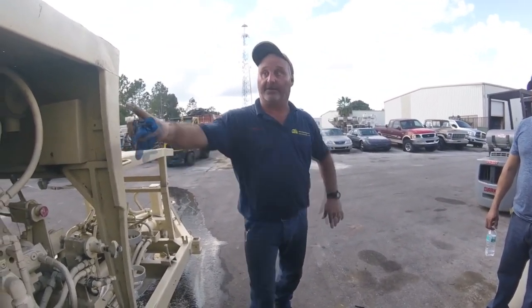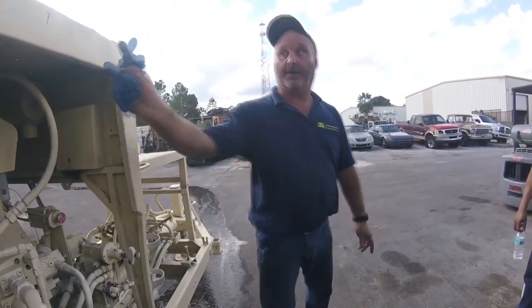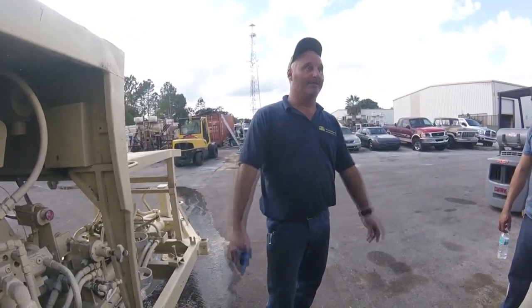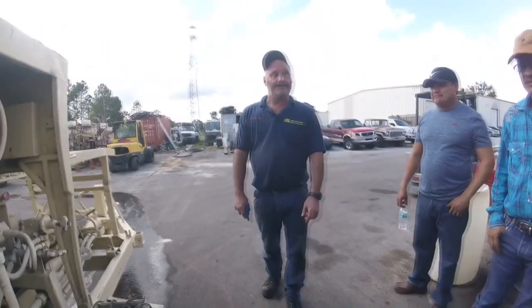You're going to see a drastic difference. You have a 3-inch slump coming out, and it's like curb mix, and you add 10 gallons. You're going to see it go from 200 down to 150 real quick. It doesn't take much water to change the variance. But then you add 10 gallons, it might not stick on the chicken wire either and fall off. So you're going to stay in the 200.